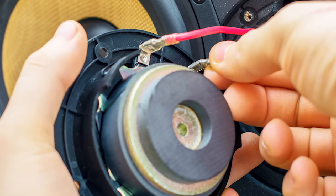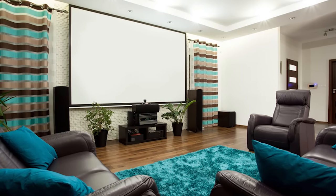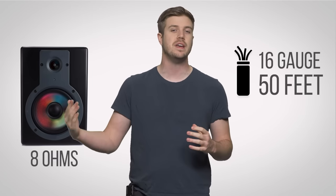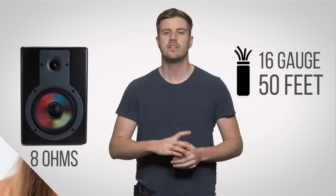And it's especially important for higher-end speakers with impedances of 4 ohms or less. Thinner wires can be passable for very short runs, but if you're trying to install something in a larger room or want any kind of surround setup, it's important to pay attention to the gauge of the wire — a standard measurement of thickness that can be a little confusing, since a smaller gauge number indicates a thicker wire. If you're rocking 8 ohm speakers, for example, readily available 16 gauge wire will give you good performance up to 50 feet. But keep in mind that since speakers can have variable impedance depending on what frequency they're playing at any given time, it's not a bad idea to pick up wire a little bit thicker than you need in order to compensate. You should also try to stay away from wire runs longer than 50 feet regardless of the thickness, as it can cause you to lose a little bit of the higher frequencies due to copper's electrical properties.